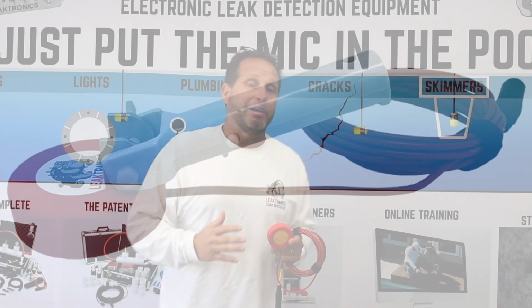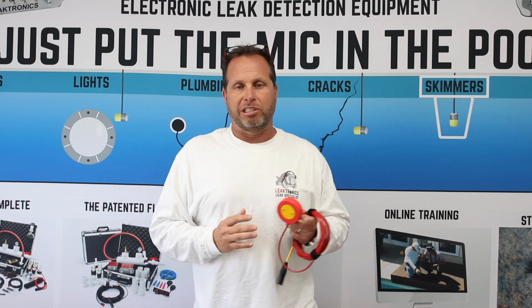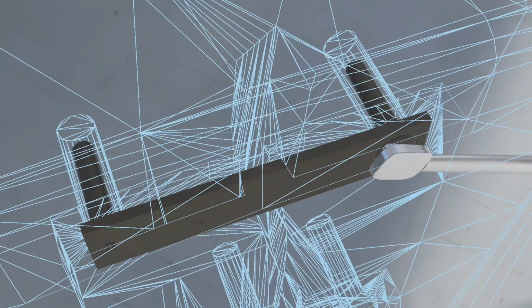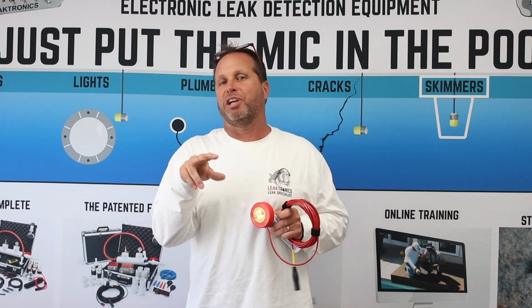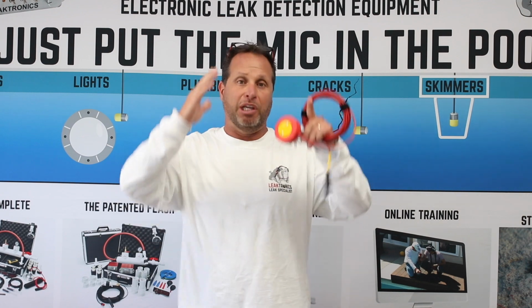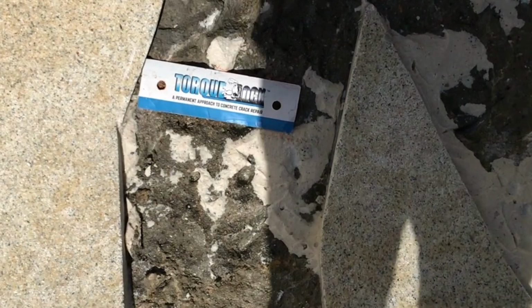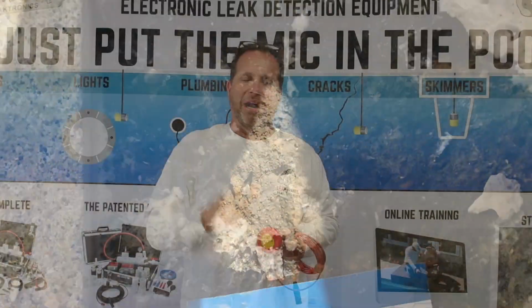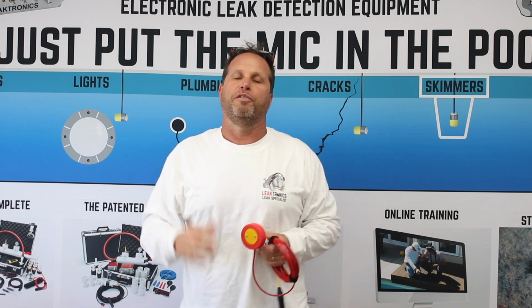When it comes to repairing the structural cracks, a post-tension staple, the torque lock staple, is what we recommend using. It's the only post-tensioning strengthening device on the market. We drill on either side of the crack, we put our template on, we cut around the crack, and now we cut wide. We take a nice wide cut and set our templates within that wide cut, and one of the processes of doing the actual structural repair is using a waterproof product.